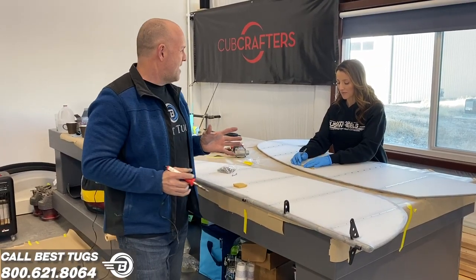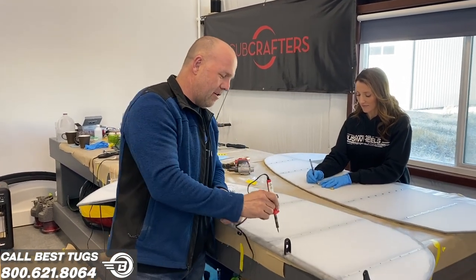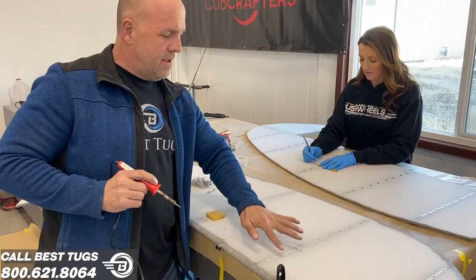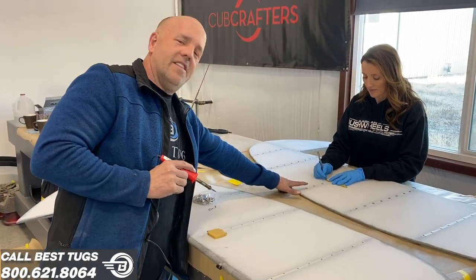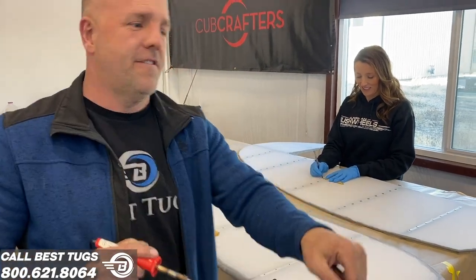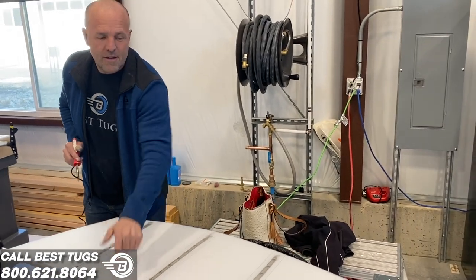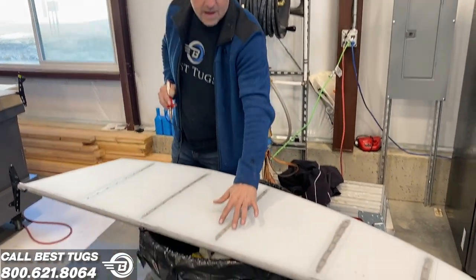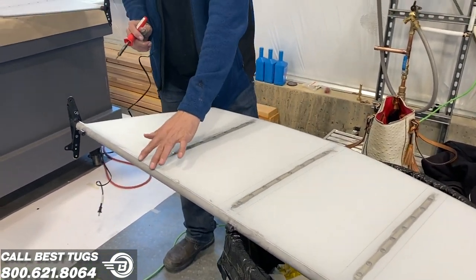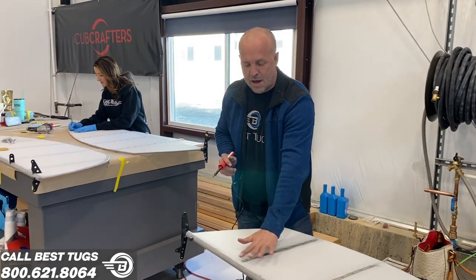All right, guys, let me show you what my wife and Monica have been working on. So use this to burn holes through the little tape for the rivets. Then Chandra put the rivets in here. The next step after that, over at the rudder, we put glue down. And these little pencil lines are the lines for what would normally be a 2-inch tape. We are putting that down to bridge across the top of the rivet.